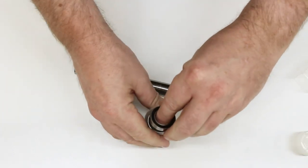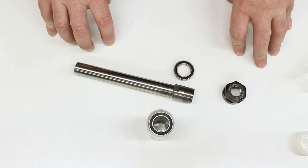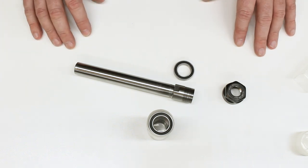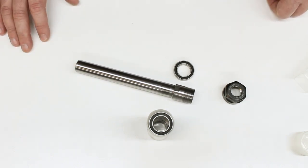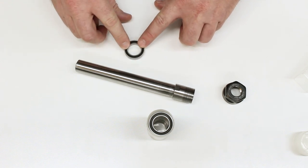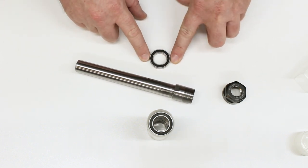These are the bearings — the bearing designation is shown in the corner of the screen. I decided to go with rubber-sealed deep groove ball bearings. The ideal bearings for a spindle would be either angular contact ball bearings for a high-speed spindle or tapered roller bearings for a slower, stronger spindle. The problem is that because I'm trying to keep the outside of the spindle housing to an inch and a half or less, I just couldn't find readily available angular contact ball bearings that would fit into that space. After research, I think these deep groove bearings will work fine for this application — the real issue relative to angular contact bearings is axial thrust loads, and I think these are going to be okay, rated for about 900 pounds radial dynamic load.